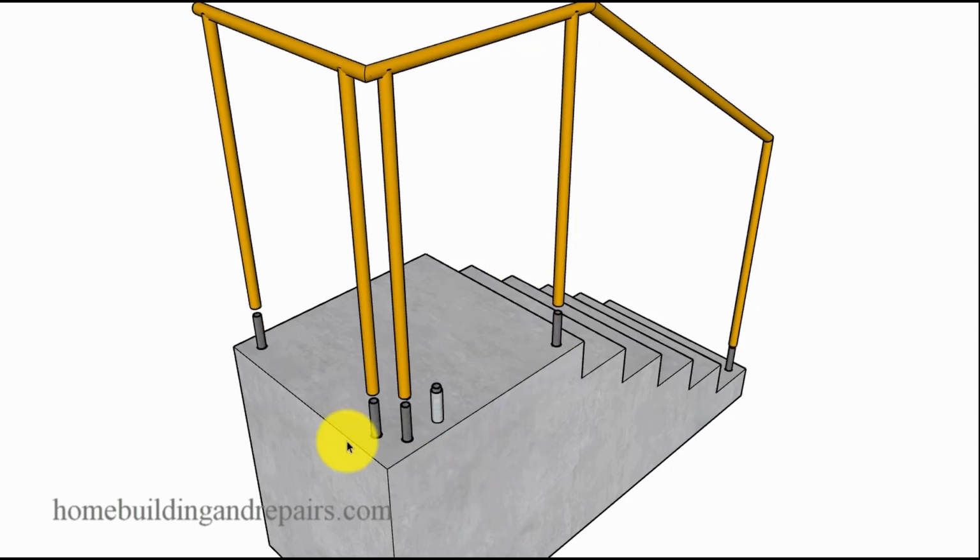Because what I'm suggesting is that you find a pipe that is a little smaller in diameter and will fit inside of this pipe. So for example, if you can get the handrail system out, you will be cutting the damage off or the rust so that the handrail system will sit on top of the concrete. This handrail system will not go into the concrete here. It will be sitting on top of it. But at the same time, it will be going over the pipes, it'll simply just slip right over this. And again, this will work if you can't get the pipe out of the concrete.